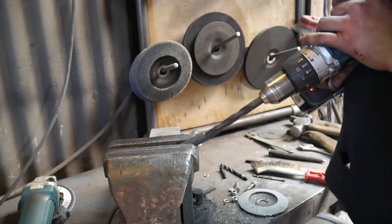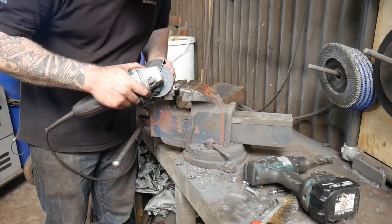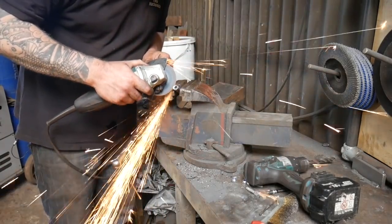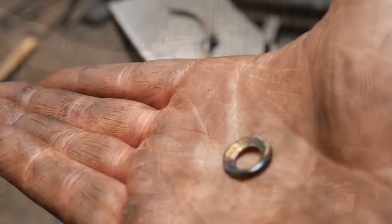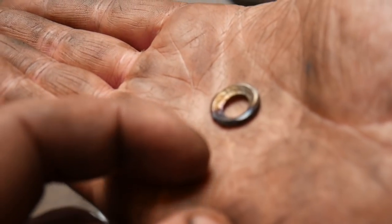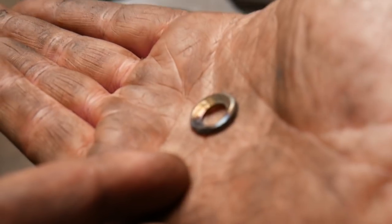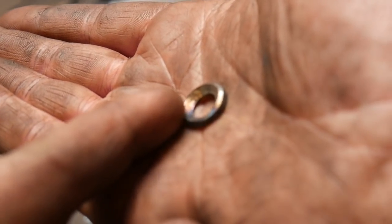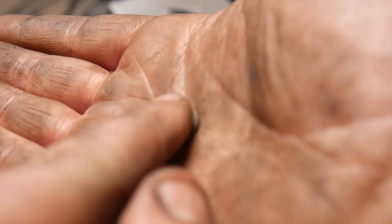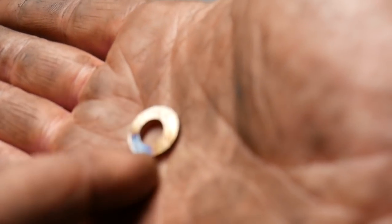To make the spring washers, I forged some of the recycled forklift truck tine from the kits into round stock measuring 16mm or 5/8 inch in diameter. The washer has a hole the size of the rivet — 8mm or 5/16 — through the center, with a large countersink on one side and a flat on the other. Under compression that acts like a spring. Because this is forklift truck tine I can heat treat it to make it springy.